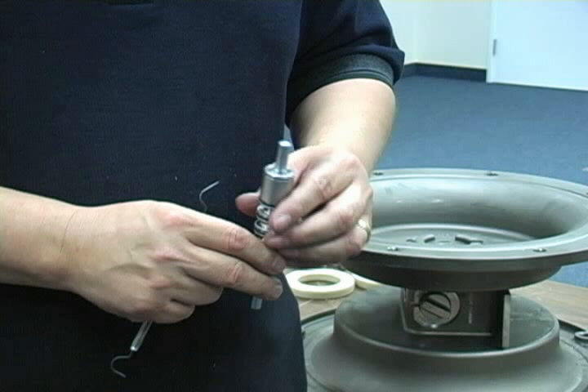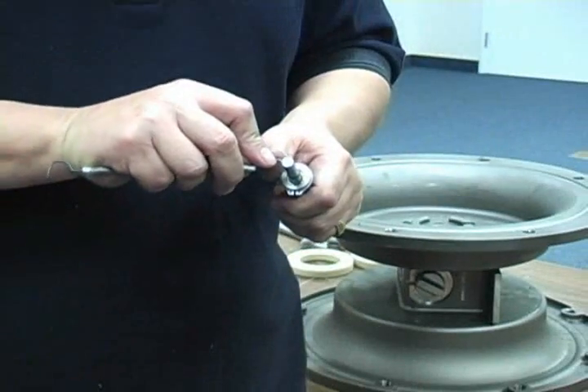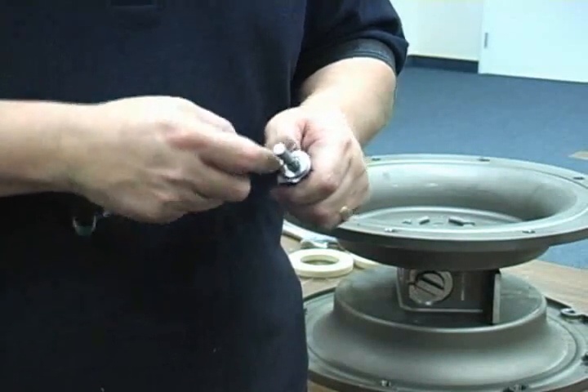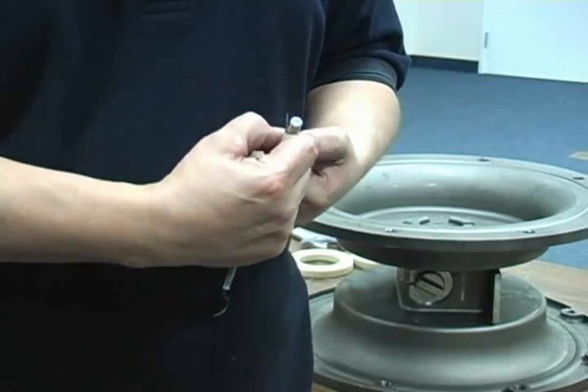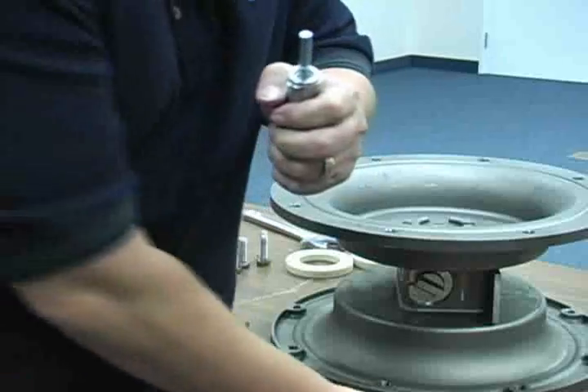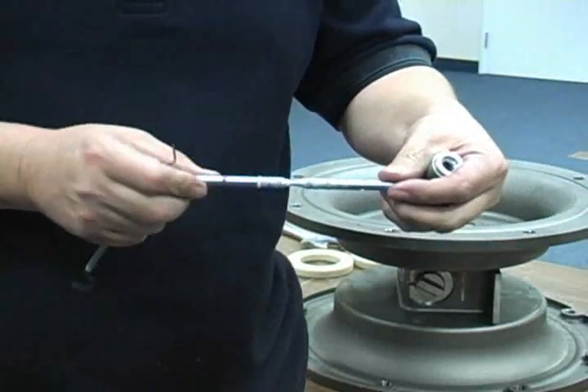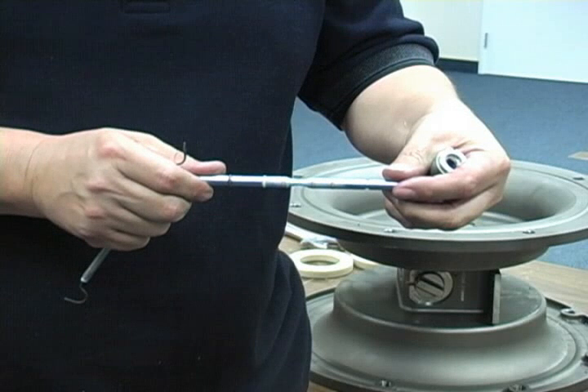To inspect the anti-double shift O-ring and the pilot spool seals, you will need to remove the retaining O-ring on the opposite side of the small indentation at the end of the pilot spool. You may now remove the pilot spool from the sleeve. Removing the spool in this fashion will prevent damage to the anti-double shift O-ring. If the spool has been immobile for a prolonged period, a compression set may cause the spool to stick in the bore; a light tap on a solid surface will free the spool. The pilot spool capsules are not available for individual sale and should not be removed.